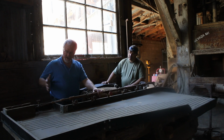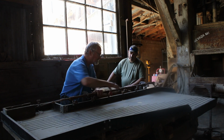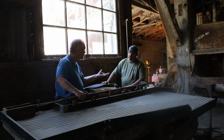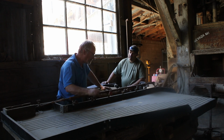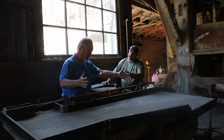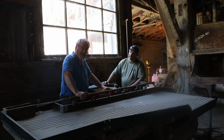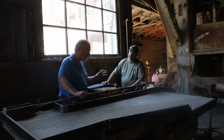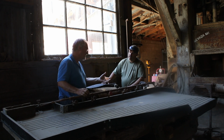What would happen is the material comes in here. I don't know if you can see it, but there's a whole bunch of little riffle lines across this. You had asked me what mesh you needed for something like this, and around 20 mesh, 30 mesh is a good size for these. You can buy them like the RP4. Have you ever seen one of those? I've seen them for sale, but not in person. But again, they still have to be bolted to the floor, because if you don't solidify them to the floor, the whole thing will just shake, and then you don't get a good recovery of the gold.